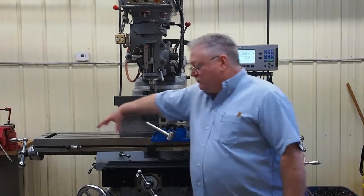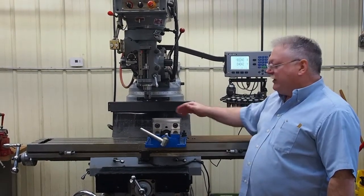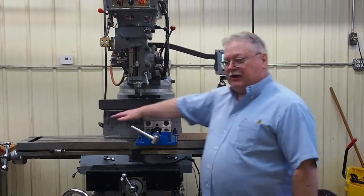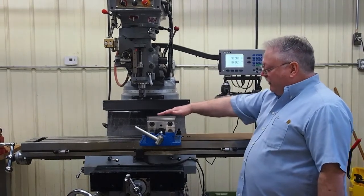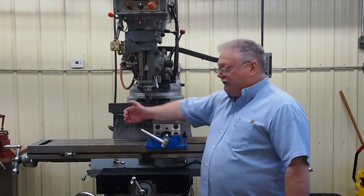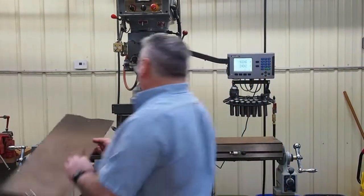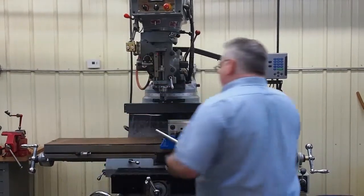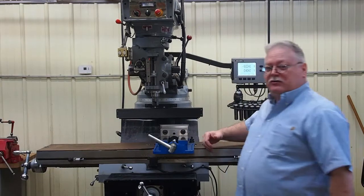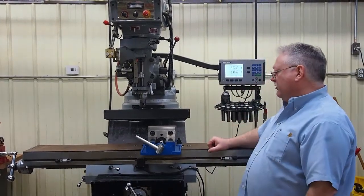You're never using the area out on the ends — that's like brand new. The area within that six inches for your ball screw, your ways, your ball nut — all of that is getting wear. So if you tighten your machine up after it gets sloppy in that area, it becomes really tight in the other areas. What we do is mount our vise off center, and from time to time we'll shift the vise over. Instead of being in one position, we'll shift the vise over and swap the short panel to one side and the long panel to the other. This extends the wear area beyond just six inches — we can get more life on the machine and keep it tighter over a longer stretch rather than a short one. It works very well.